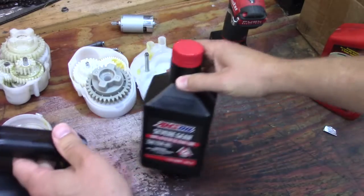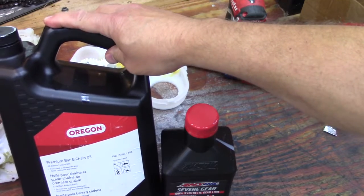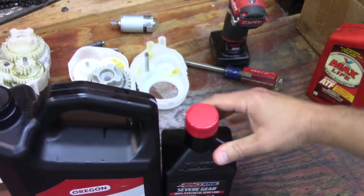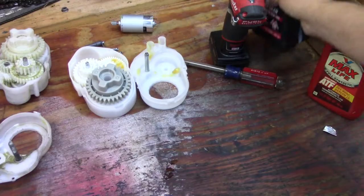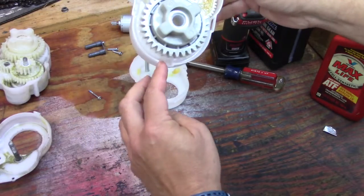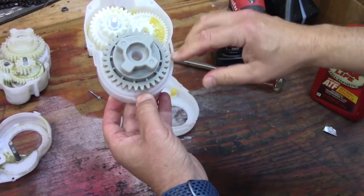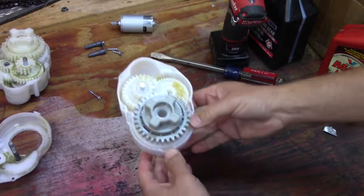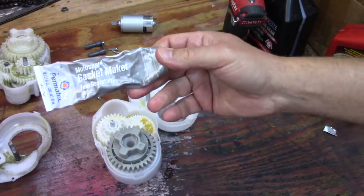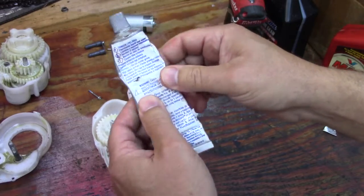The chain bar oil and gear lube will both provide lubrication. I think I'm going to try chain bar oil first, and if it's not enough I'll go to a gear oil. The next challenge is how to seal the gearbox. The groove here is nice but there are tabs and potential leakage areas. I'm thinking of using MotoSeal gasket maker, which is fuel resistant and can hold up to oils.